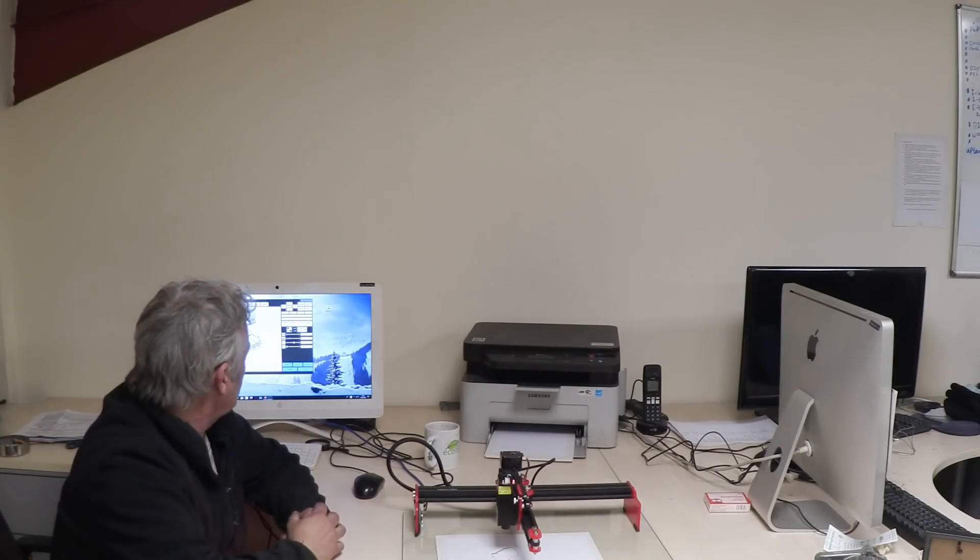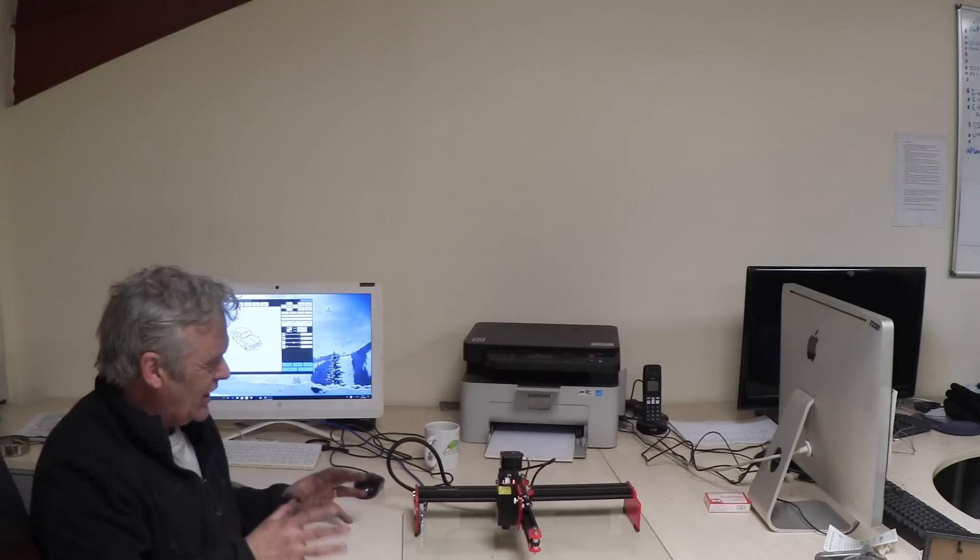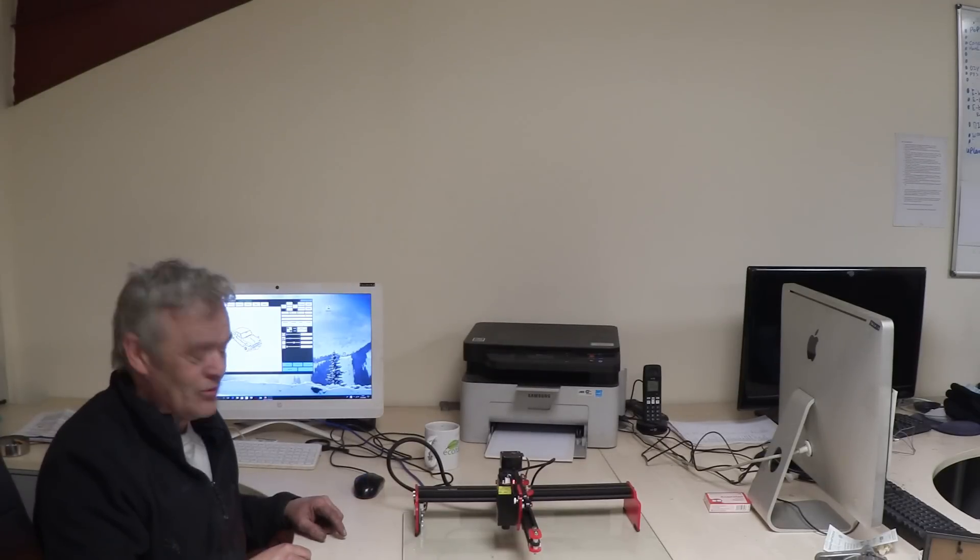For something like outline mode you can change the speed and the strength setting — obviously we'll need full strength if we're cutting acrylic. I put a piece of paper down and did the car design they had included, and it did it beautifully. You can also reset where the center is so you know where the laser is positioned. There was a bit of burning on the glass underneath, so I'll need something non-flammable as a base. But overall it actually looks like an awesome piece of kit.